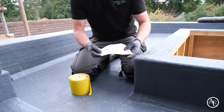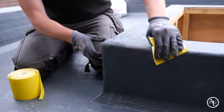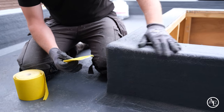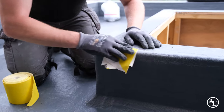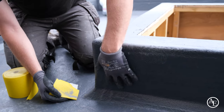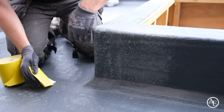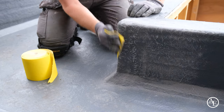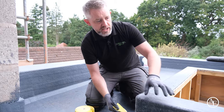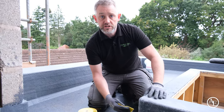Sand by hand because you can feel any sharpness coming through and get the edge nice and smooth. On front edges, run over them. Spend a lot of time on your corners — you want those nice and smooth for a better seamless look. Take special emphasis on your corners and definitely your upstands. You need to address any issues and avoid any water ingress because we want a seamless, waterproof roof. We've got FRP trims coming up the upstand and over the round, so we need to reinforce where the trim meets the board or where it meets another trim.